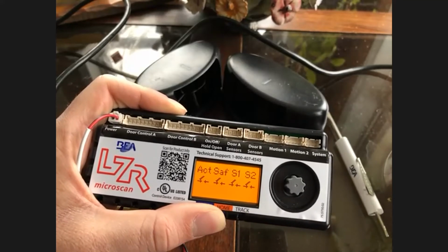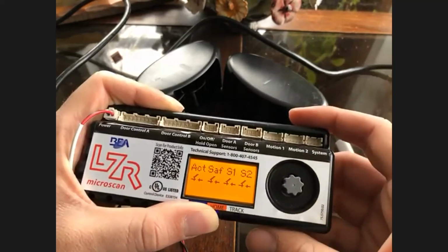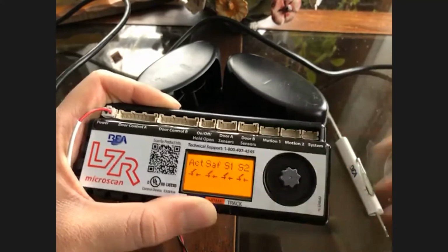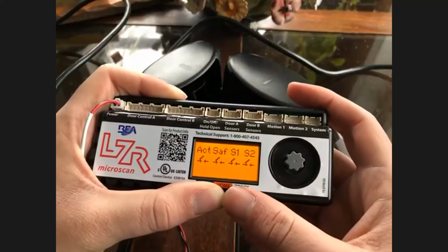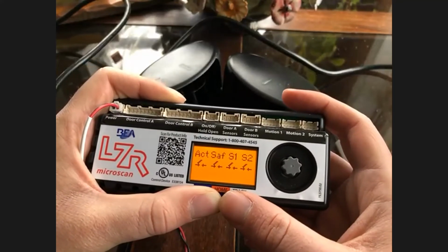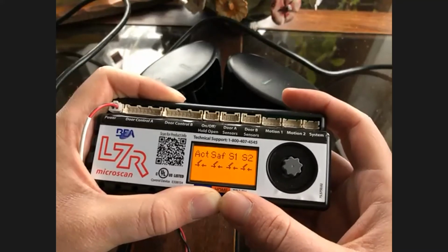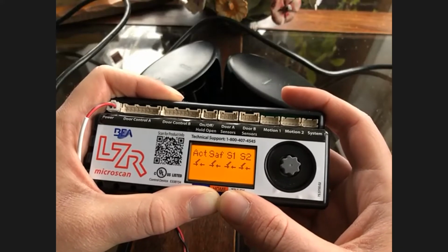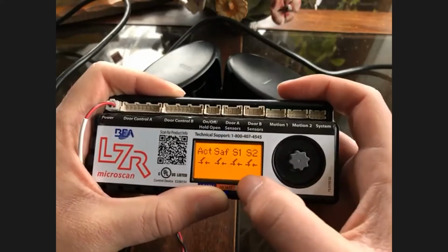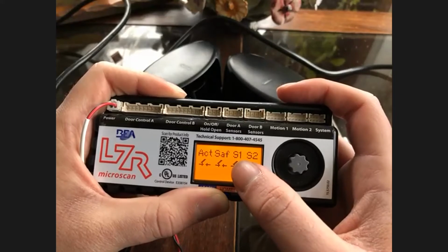Both settings and codes are shown in the hub at the same time, once in a manual, especially when you program a new system. So I had a comment about that. When you're looking at the error, it's going to say NB1 or NB2 or NB4. That's telling you how many sensors are part of the error, if it's 1, 2, or 4. So make sure you're not mixing that up with what's actually displayed with the error below, because it'll say NB2 EDPS. The EDPS is the error. The NB2 is talking about the amount of sensors.